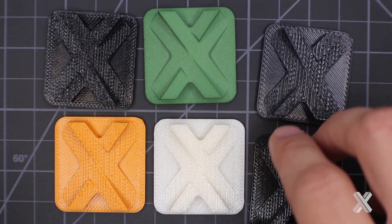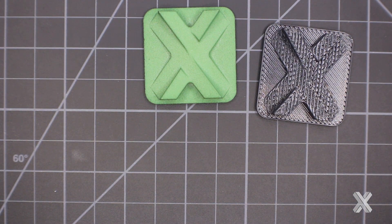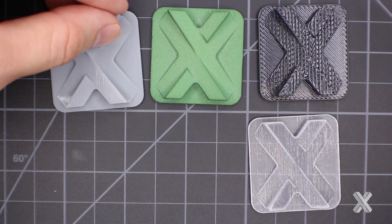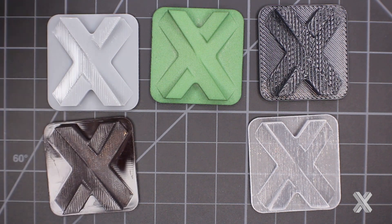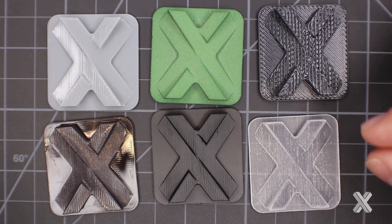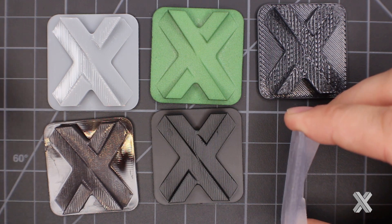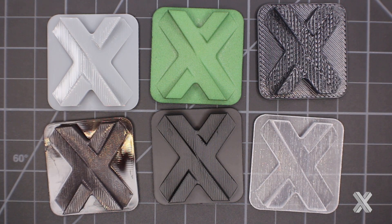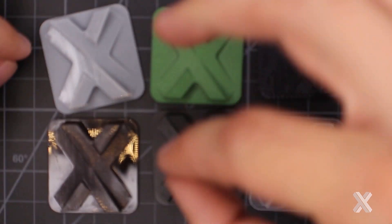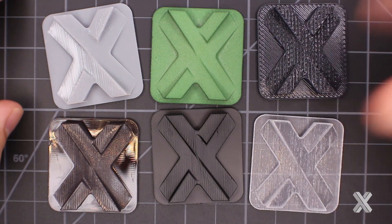Let's move to some of our photo polymers. I'll bring in our PolyJet piece — some PolyJet VeroClear material — and a couple variations of SLA pieces to show the difference between finish options. PolyJet creates parts with micro droplets, so it's going to have a little bit of streak to it, with a matte semi-layered edge. With SLA, I have a gloss-like upper level on my natural finish — these parts were built from the bottom up, and that liquid resin when cured essentially has that puddle-like effect, giving that gloss.